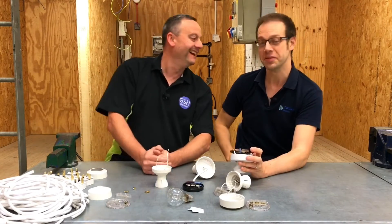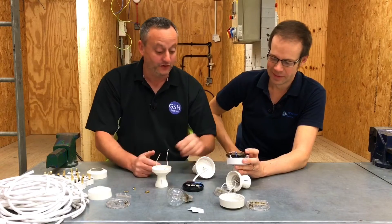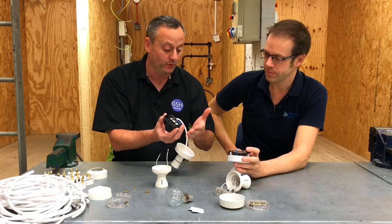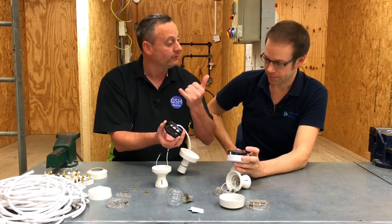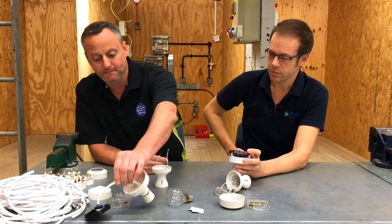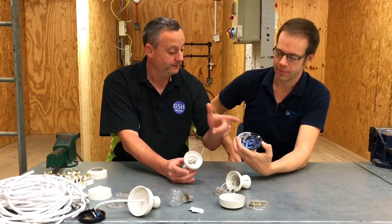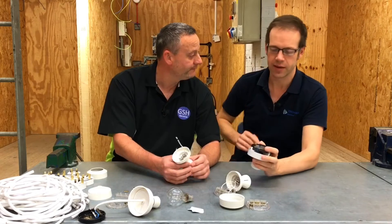When we're looking at the flexible cord coming to our ceiling rose and pendant, as it's a flexible cord, the conductors are always going to be blue and brown. It's only in the batten lamp holders where we can have a combination of either the white or identified conductors — sometimes you get white, absolutely.